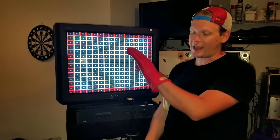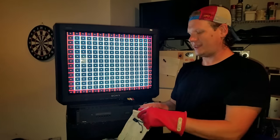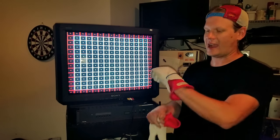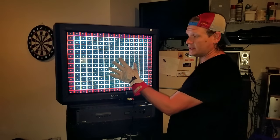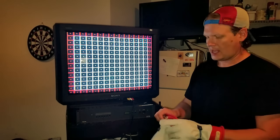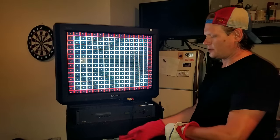What I've got here is a high-voltage Marigold industrial glove. What I do is I wear this glove and then I put a second layer over top of it to give me double protection. This is a high-quality leather glove on the outside, so now you've got dual protection for when you're working back behind the CRT while it's turned on. Take your time, make sure you've got the right personal protective equipment - don't try to save money on gloves, it's about the only thing you can use to protect yourself.